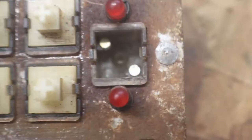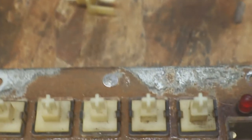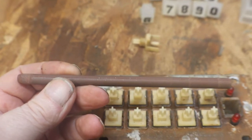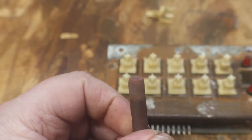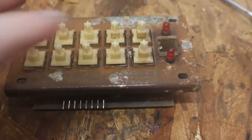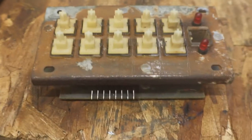How I clean that — for the one that was really bad, first I take a little screwdriver and just kind of chip off all the real heavy, hard stuff. Then, if you don't have one of these, I suggest you get one — this is a light socket cleaning tool for pinball machines. That end is flat so you can get right down in there, twist it on it, and clean it up. You can see it polishes it up really nice. So now our reset button should be okay. I'll work on all of them — I'm going to pull them all again and check them all.